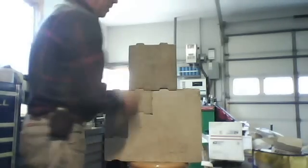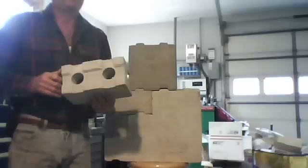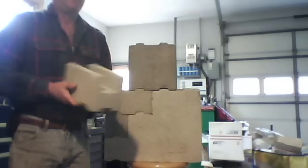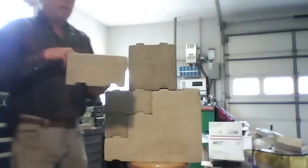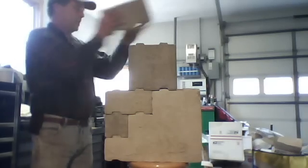When you get to the top of your wall, you have what you call a bond beam. And you notice it's locking. We do have a little block over your doors and your windows, which is flat on the bottom. Then you just build a frame and set your block over the window or door. Put a cage in it where your rebar comes up through the hole, and then you pour it full of grout and put your hurricane plate on top of it, like so.